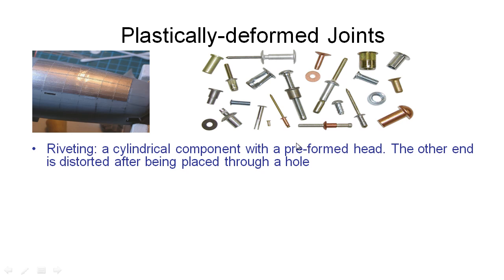There are lots of different types of rivets. In the middle here we have a typical pop rivet — you have a pop rivet gun that holds this and then pulls a piece of steel through the softer portion of the rivet, deforming the rivet up until a certain point where the force increases and then the steel breaks.